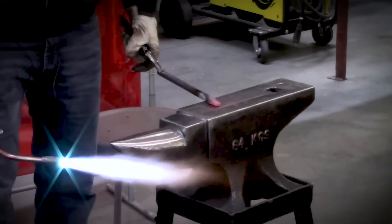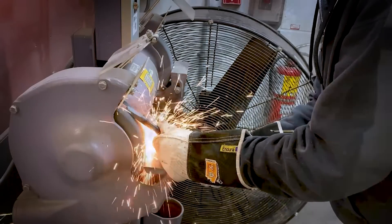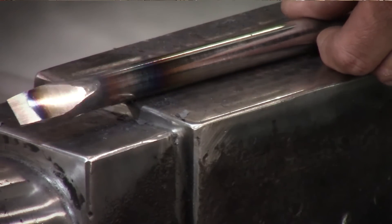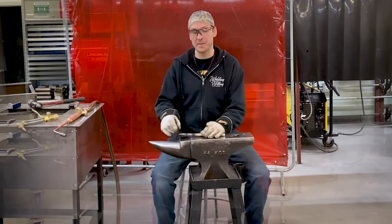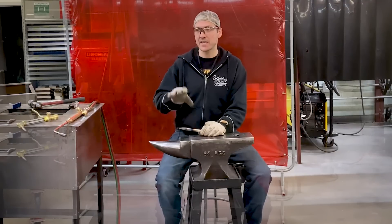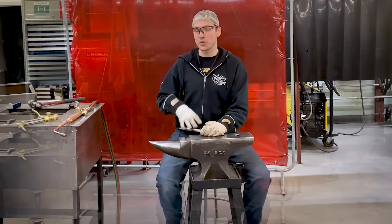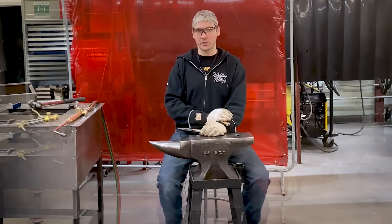Now that we have the desired shape, it's time to pull it and finish it on the grinder. Now that I have my chisel shaped to the shape I want, I'm going to take the torch and heat the tip up again and quench it. That's going to give me the hard tip I want. I'll give it a final shape, get it nice and shiny, and then bring it back to heat it up below the critical temperature — that's going to give me the right hardness for a working chisel.